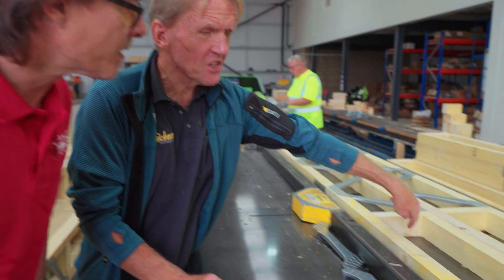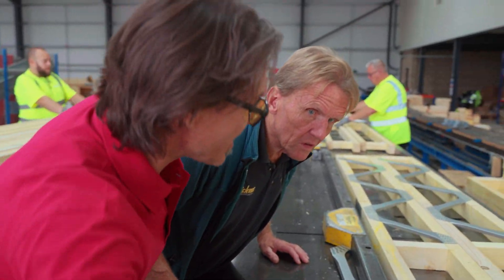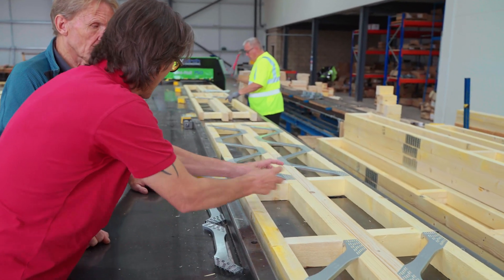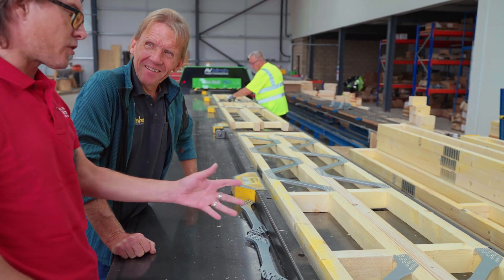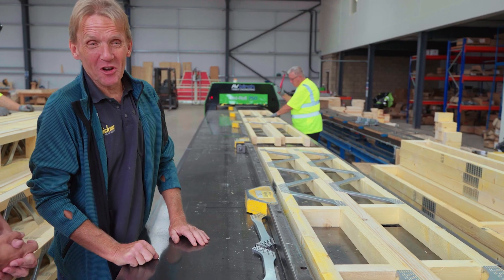Have they missed some webs out? No, not at all. From each end we've got the webs coming in, and if we didn't have this gap in the middle there'd be a bit of an argument between them. What the gap is also very handy for is services — your ducts, pipes, that sort of thing. Absolutely, that's why I love these, because it saves a lot of drilling.